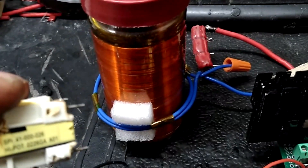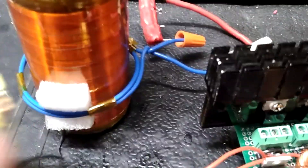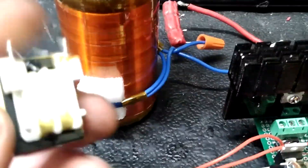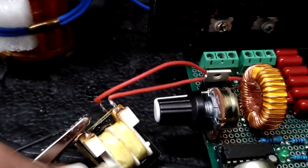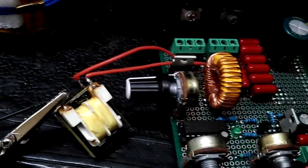This one — I can't see the part number, but either way they're just line filter inductors. While these two weren't identical, I pulled them off the same power supply board and both would work interchangeably; there's only a very slight difference. Grab one of those randomly and it works. Same thing with this one with the yellow cord — just put about 20 turns on there, boom.